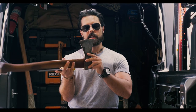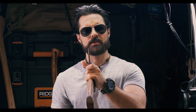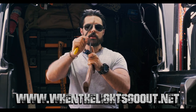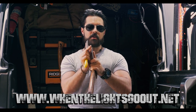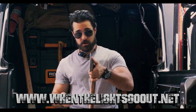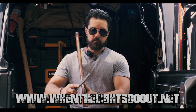Now that I have my blade relatively reprofiled and all the chips out, I can feel a large burr on one side. What that is: I'm filing the metal to a very fine, thin point, and whichever way I'm pushing against to sharpen, that little metal is folding over on the opposite edge of the apex. So I sharpen it this way, the burr forms on the other side; sharpen the opposite way, the burr does this dance back and forth. At this point it's already fairly sharp minus the burr, so I start to lighten up and increase the angle ever so slightly just to remove that burr.